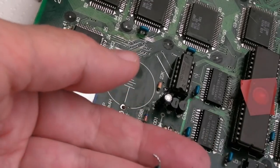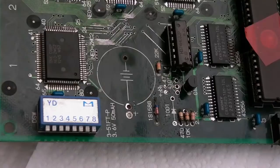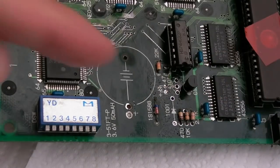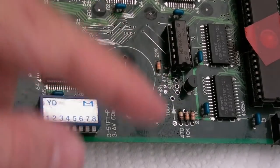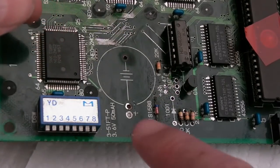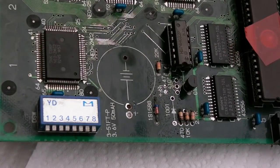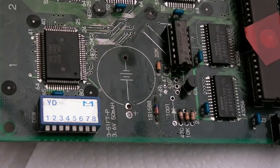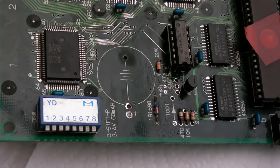That's it. So it was cathode towards the top there. And there we go, just tinned up those pads there, the diode pads, the cap pads. Need to clean around it, unblock the holes, and then just inspect around, and then I can reintroduce those components. I'll then take off this diode and that transistor. I'm doing things in a sort of weird way here. I can still see the silk screen outline there of the transistor, but what I didn't want to do is get them flipped around the wrong way or get the transistors in the wrong order. They might be different transistors, etc.